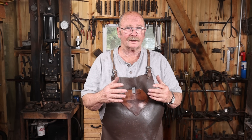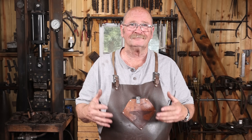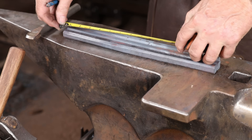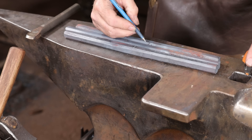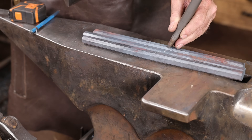So if you cut these in different lengths and have an idea of what tools you're going to make and how much a tool will grow versus spread as you make it, you'll end up with a set of tools that's more consistent in size. Not really critical — it's okay if you do it one way or the other, but it's nice if things match. This is also a good way to make an intuitive guess on how much these are going to draw out and see how close you are to being right. You start to get an eye for that kind of stuff over the years. Worst case, you can always trim the long ones down and clean the ends back up.